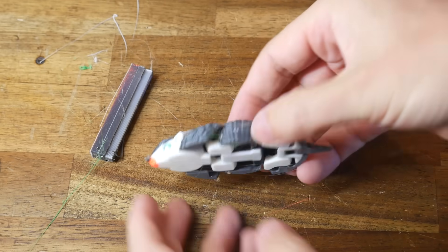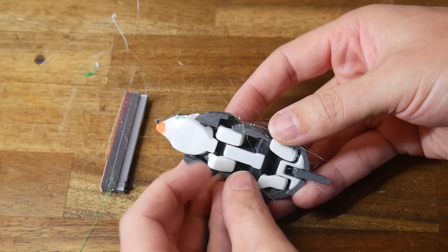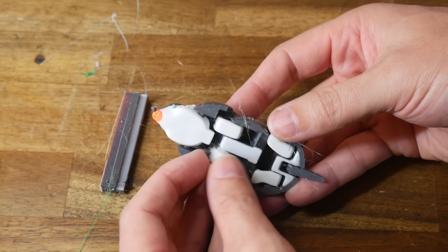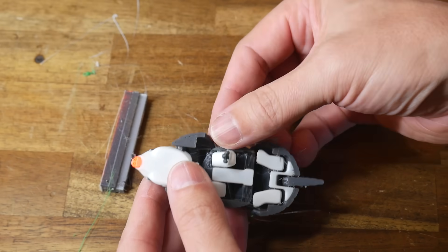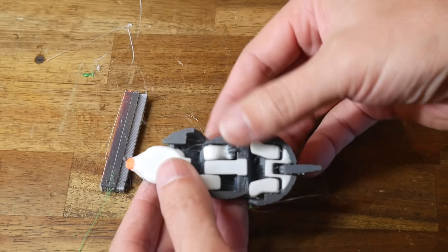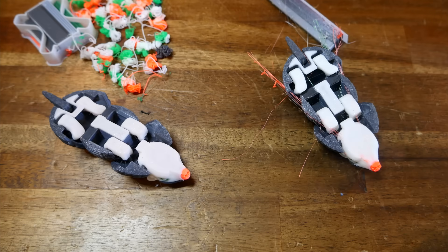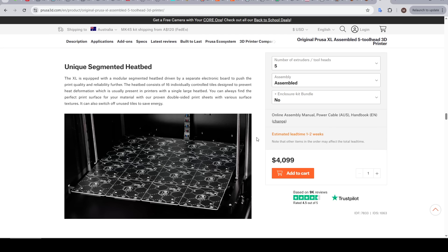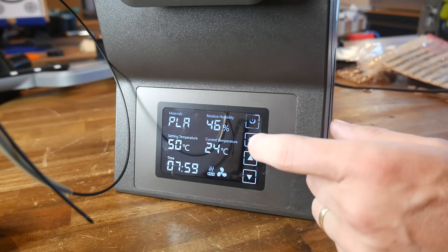The improvements I noted during assembly appear to target reliability rather than print quality. I think by now I have enough other printers to compare to and enough XL testing to conclude that the XL inherently suffers from more stringing compared to other printers. It has improved to the point where it wouldn't be too hard to remove most of the time, but it's still definitely a downside and frustrating. And people always say to dry the filament, but remember the same filament is fine in other printers, and there's not much point having a segmented bed if you're consuming that electricity elsewhere by using filament drying systems.